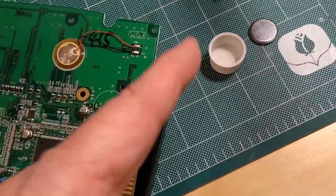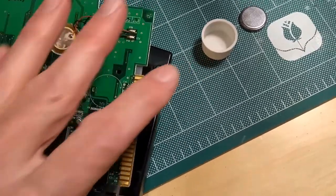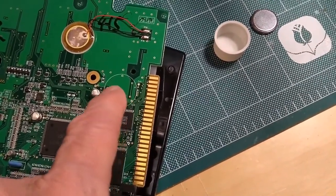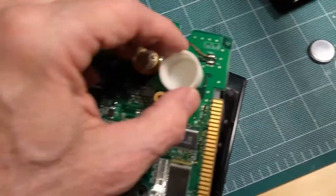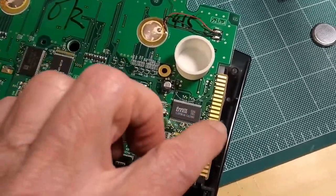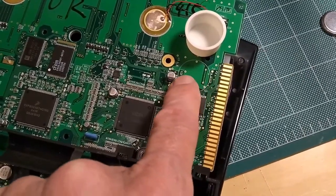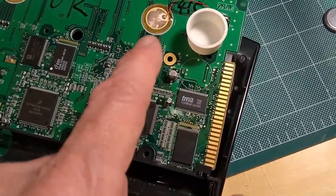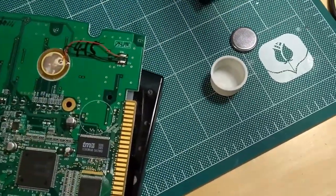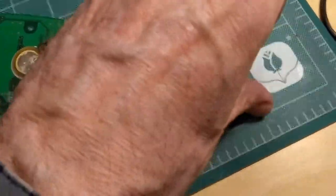And then now, this is going to be the tough part, is making a spring-like metal clip on top that will push the battery down, hold it down, and will also feed into the other connector, probably via some kind of wire, because I think this, if I pick it up, is wider than the 2 holes that I just showed you. Yeah, the holes are, let me just move this out of the way. So the holes are here and here, and this thing is going to cover both. So I'm going to have to pull a wire from both of these to feed into the metal parts that are going to make contact with the actual battery. So I'll be right back. I'm going to cut this, and then we'll see how that goes. I'll cut it with my Dremel, and then I'll be back.